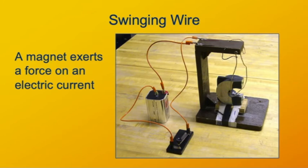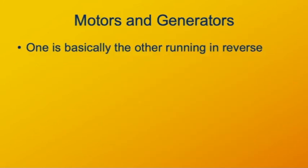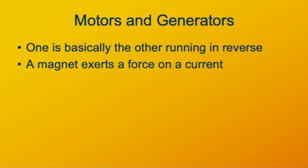This is essentially how electric generators and electric motors work. The electric generator exploits the idea that moving a magnet near a coil of wire generates an electric current — that is how an electric generator works. If you run an electric current through a magnetic field, the magnetic field pushes the wire of current — that, in its essence, is how an electric motor works. Electric motors and electric generators are essentially the same thing running backwards. An electric motor takes an electric current and generates work to cause the armature to move; an electric generator has a moving armature that generates an electric current.